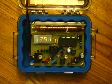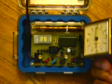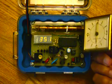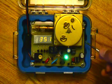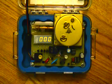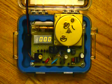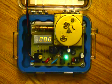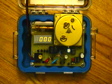My next test source is an old clock I bought at the flea market — a Westclox with illuminated dials painted with radium. I've set the hands to 12 o'clock and 6 o'clock positions, which I'll put in parallel with the Geiger tube, and I'll reset the counter. We expect to see about 800 to 900 counts per minute, which is roughly about 15 counts per second. The radioactive source on this sample is radium, painted on clocks to allow them to be read at night.